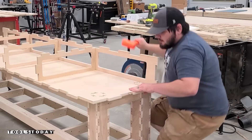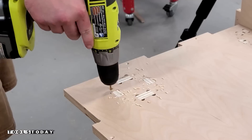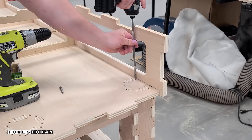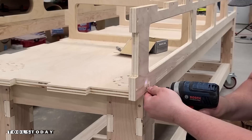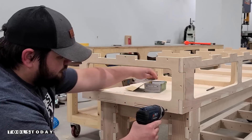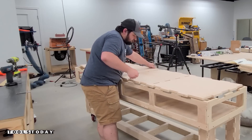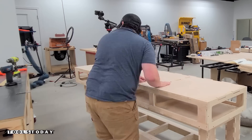There was no room for error and I'm glad to say everything worked about as flawlessly as it could have. Everything fit great and it's really cool to see those coming through. We used those countersinks drilled on the CNC machine and screwed everything in place. I used an extension bit on the back where it's really difficult to reach to pre-drill and then screw all of those in as well. Now we can screw in from the back side, and then we'll get the side panels all put together. I didn't do any of the screw holes on the top area as I needed to make sure I had enough wiggle room if I needed to adjust anything for the top. We'll install the front panel, get that all screwed down, and then install the top panel — leaving those screw holes open to fill in later once the top is fully installed.